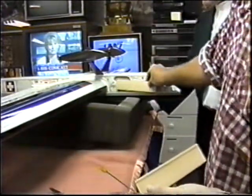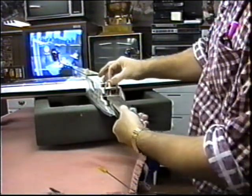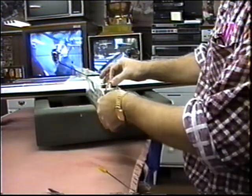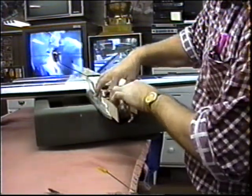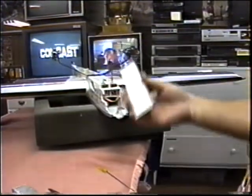Get out some eighth-inch plywood to make side tank shims. Let's show this on the tape. You got a tank there? Yep. Here's the deal. I did this for Bill Rich one time and it worked real well. If you have a crack in the plywood, you see how this tank, because he's got a wide body, has some side-to-side clearance. Well, I know I can use eighth-inch light ply to make side shims here, and it'll still just fit, so you'll still be able to get the tank out. So all I need is the height here, and then we'll fiberglass them right in. That's clean as a whistle inside, by the way.